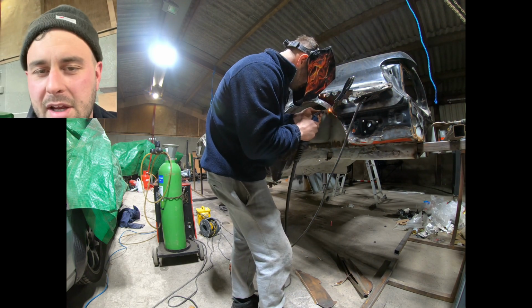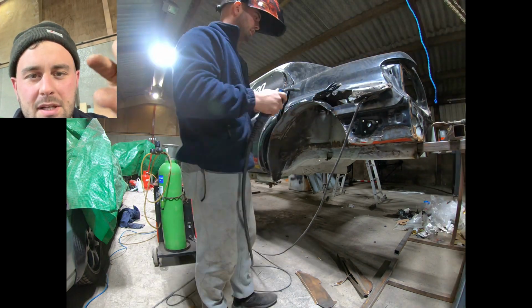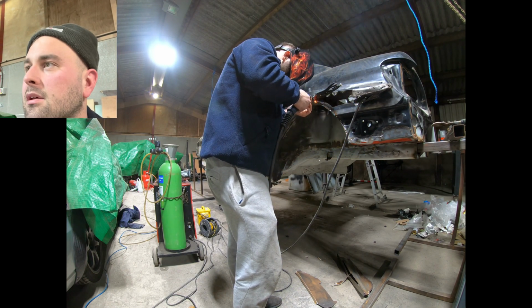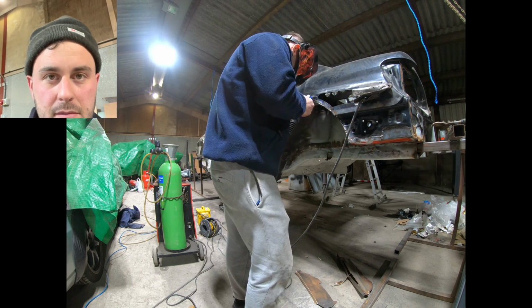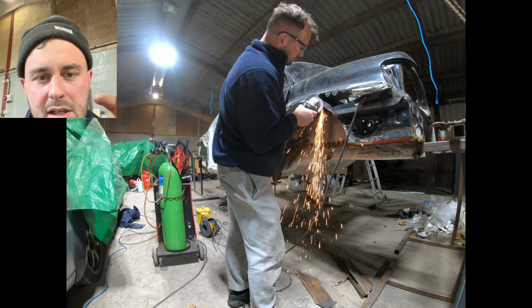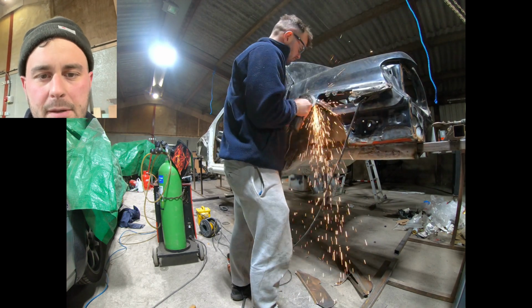I've got that heater on again, but basically what I'm doing here is I'm just putting a thin sliver piece in, making up for the arches, just so I could get the riv nut in for the carbon arches. So basically, that's all I'm doing here. Just having to tack weld it in very intermittently, in really short bursts. It's very thin metal. That's all I'm doing.